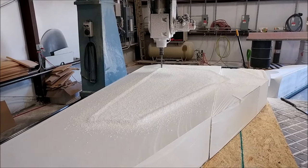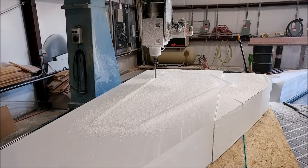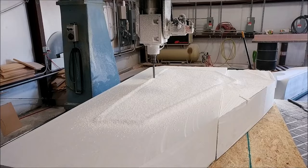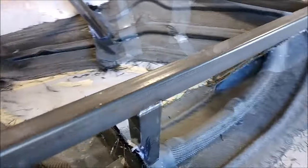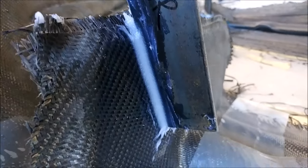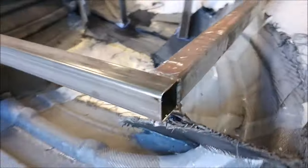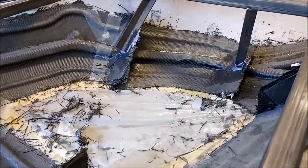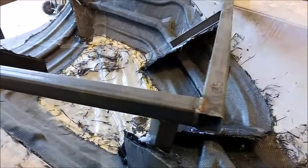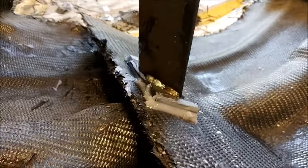This is Friday and we decided to run the upper strake skin for the right-hand side, just starting out late Friday afternoon. If you recall, last time we had welded up these frames and the adjoining little bits of right angle to meet up with those boards. Here you can see Jeff has put a layer of epoxy in between the boards and the right angle — that'll be released, and then we'll drill those next week, put the bushings in, pop those molds, clean up the edges, and start preparing to lay up the actual frames for those doors, which will be a good milestone.